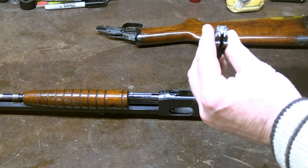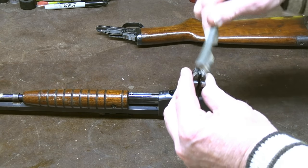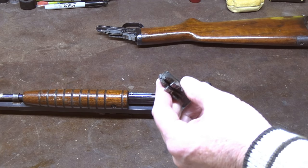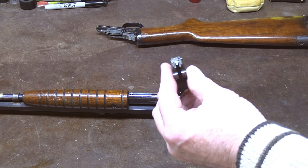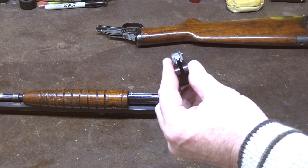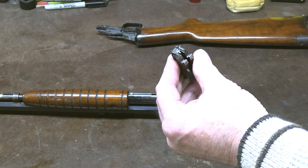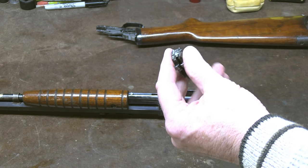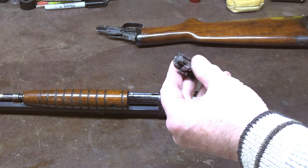I'm not going to go through the whole process of cleaning — this is a fairly straightforward procedure. This rifle has some serious pitting in the bore and in the chamber, owing to the corrosive ammo that was used back when this rifle was made. I've actually got to keep this very, very clean in order for it to cycle properly. Otherwise brass cases will seize themselves in the chamber after firing and the extractor claw will not pull the case out — I've got to pry them out with a screwdriver.